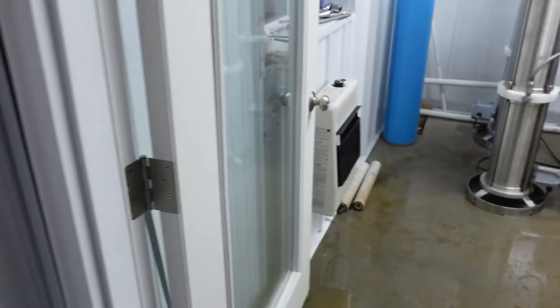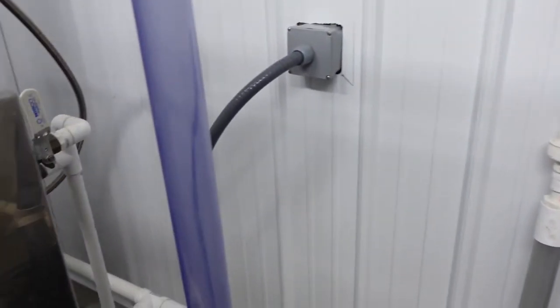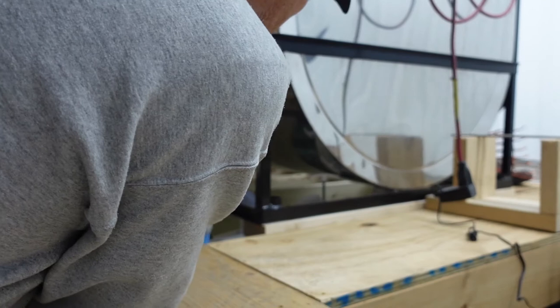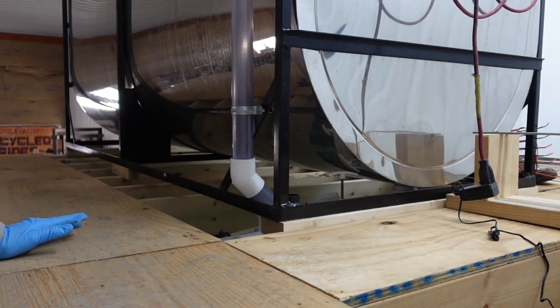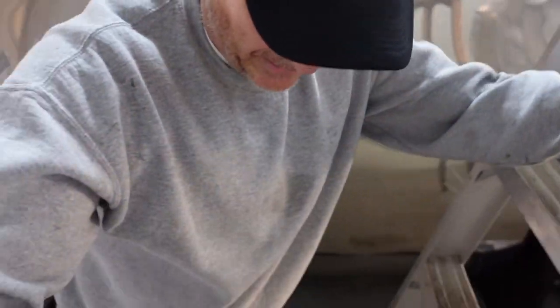It goes through the wall and now it goes in this direction here. We're going to open up that valve before the water really starts flowing, then turn this valve off. We've got to make sure the valve is closed to our big tank — there's actually a little tank on top of the big tank, so we've got to have the valve closed up here. All the valves are closed and now we're going to go back in the other room and start the RO. Check this out — look how clear that is. Guys, that's the sap that comes out of the trees. Every night we clean this big tank, so that's last night's water and today's water. We're going to start the reverse osmosis process now.